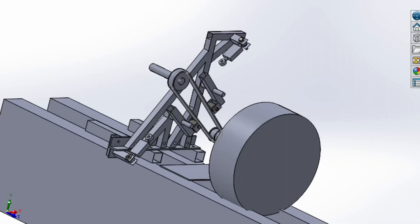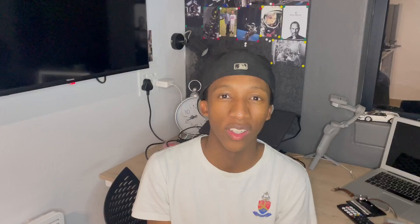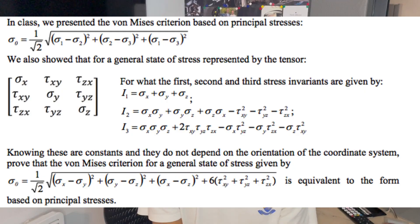Going from a CAD design to actually making it a reality was incredibly tough. It takes a lot of thinking, a lot of calculations. Something as simple as the shaft — you think it's just the shaft, but I was doing deflection calculations. I didn't want it to deflect more than a millimetre because that could affect my results. So I had to choose the diameter of the shaft, calculate the stresses according to the material, compute the safety factor, and from that determine what size shaft I needed so that it doesn't break underneath the loads.